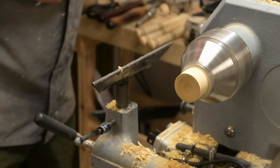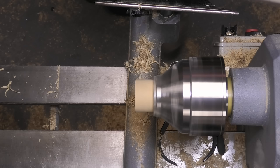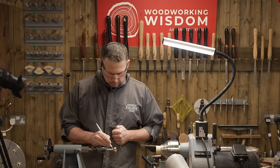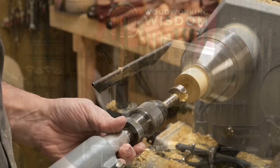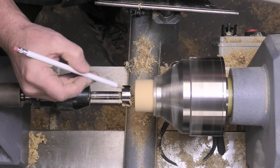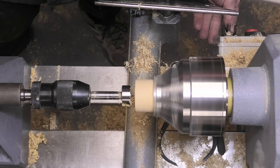Let's have a look at depth again — I'll do the same little test on the lid that we did on the body. Going to mark my drill bit. I'm going to attack this slightly differently — the actual depth of that hole is to that point there, but I'm only going to drill about three mil less than that, because I'm going to go in the bottom with another tool just to clean away the hole that the center spike on the drill bit left. I want a flat bottom on the inside.